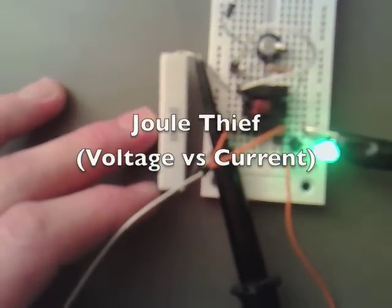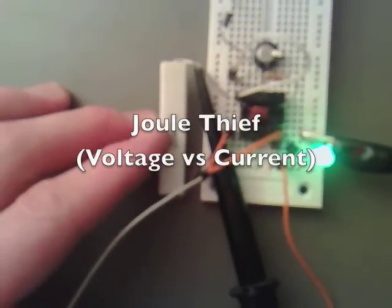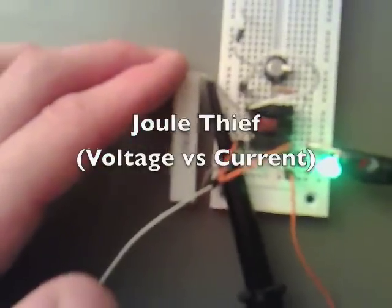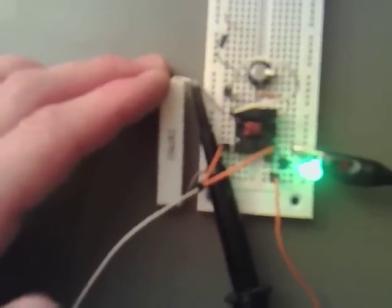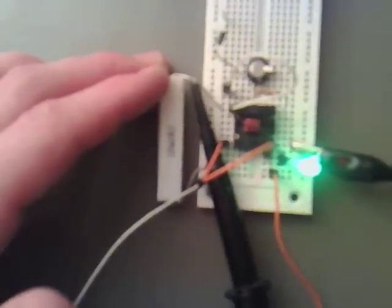What I've done here is put a 10-watt 1-ohm resistor going straight direct into the positive, so I can measure the current going in through my oscilloscope. Then I've got the other lead coming off the LED so you can measure the voltage on the LED to see what the voltage versus the current looks like.